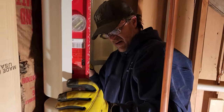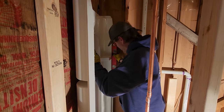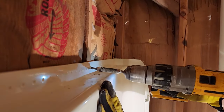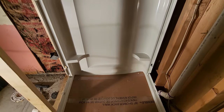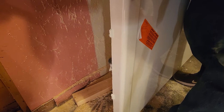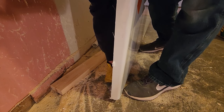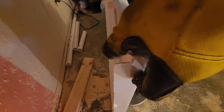Make sure this wall is nice and level. You can see Mike just taking his time. Once you get it level, go ahead and put your screws in. The reason we pre-drill is we like those screw heads to be as flush as possible. If you skip that step, you might have a little bump in your drywall, but it's just the right way to do it. Here Mike is trimming the edge of the shower walls again with his razor knife, getting all that excess plastic off.